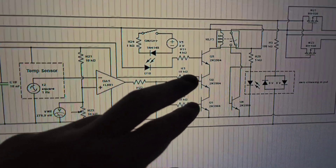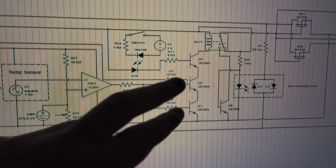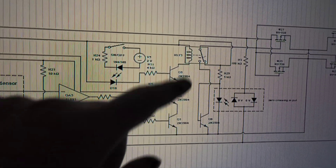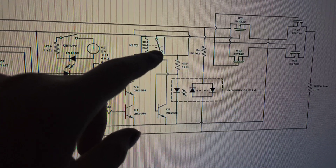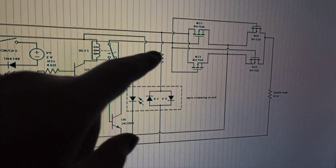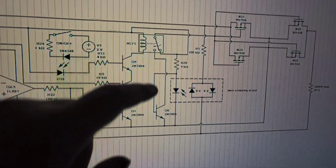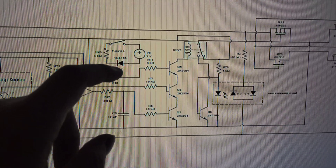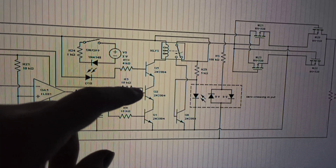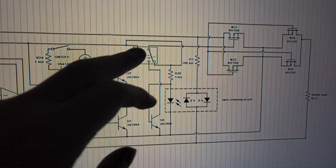These are two temp sensors that get tripped if they're high and they're inverted — so if the temperature goes too high, they shut off. If these two shut off, it shuts down by energizing a relay. The relay closes and will short the MOSFET gates from positive — where they are when you're running the system — to negative. This is also the input for the user, which is optocoupled. So if the user wants to turn it on and the two temperature sensors agree, all three inputs are true, all MOSFETs turn on, the relay pulls down and says: let's turn on the MOSFETs.